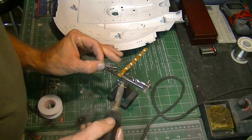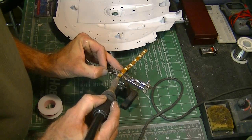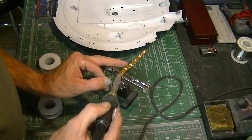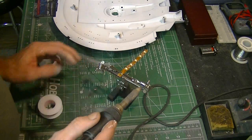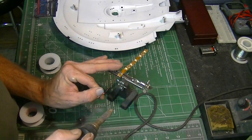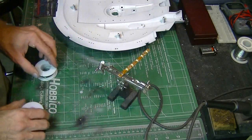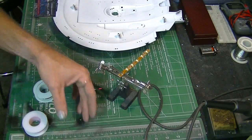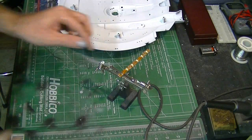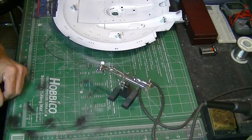Next I'm going to put a little dab of solder on each of these terminals. They're clearly marked plus and minus and have a nice copper disc on there. You can see how quickly and nicely that took compared to some other tape — I really like that. There we go, we've got our positive wire attached, and over here we're going to connect our negative wire which will be the green one. Just a little touch with the soldering iron. You want to come back after a second or two and give these a good hard tug to make sure they've contacted really well. Then trim a little bit off and we're ready to mount this down onto the saucer.